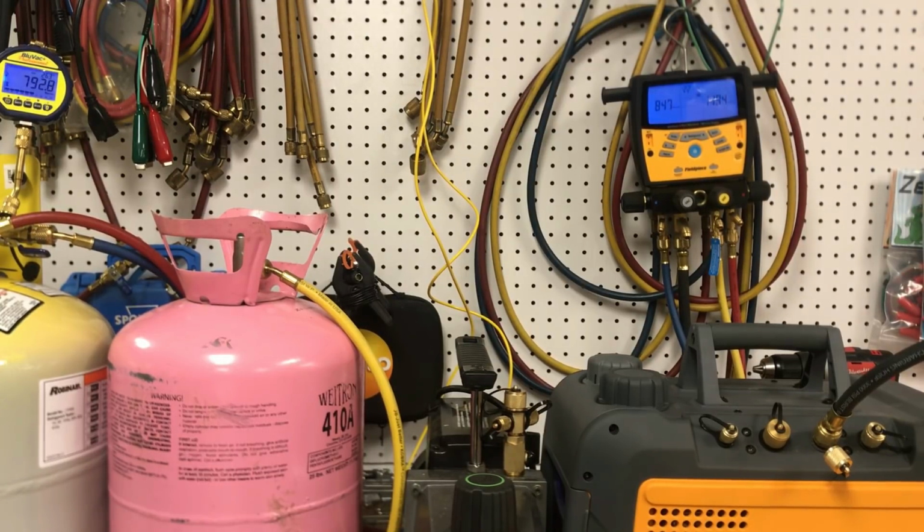Now we're down to about 780, 790 on the blue vac. The S-Man is still just above 800. And of course it's fluctuating around like the S-Man will commonly do. You know, cleaning and flushing the vacuum sensor port on the S-Man, sometimes it seems to help, sometimes it doesn't seem to do anything. But once the vacuum gets down really deep, it's stable, and I trust them.